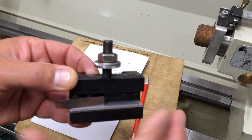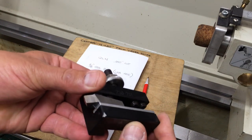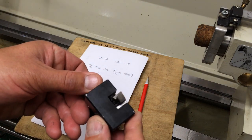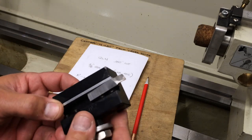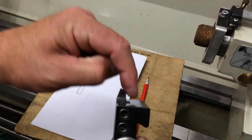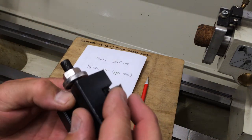From what I understand, aluminum has some really good vibration absorbing properties. A very good machinist buddy of mine local told me to give it a try, and it works. I rough ground it on a wheel like everyone else would. My angles are 10 degrees, 30 degrees straight, 10-degree rake, and all the others are between 8 and 10 degrees.